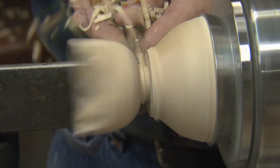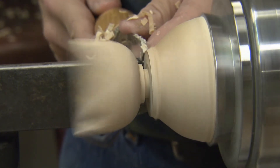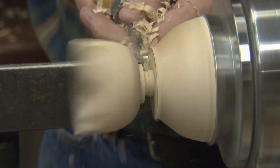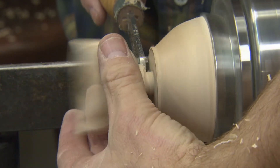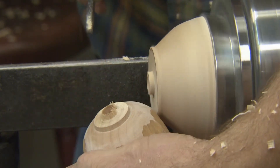I'm going to take the parting tool and start a cut in here — I want to clean that up really nicely. Make a relief cut. Remember, I have a hole drilled in here because that's going to accept the tenon from the handle we're getting ready to turn. I've got to be ready to catch this — don't put your fingers on the tips or that will hurt. There we go, nicely done.